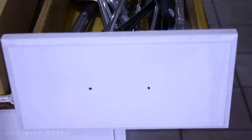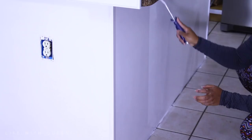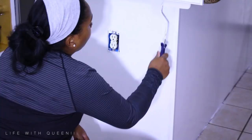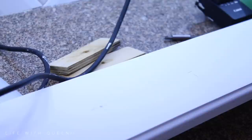When I restarted painting my cabinets, I used the same foam roller for all of the bottom cabinets, all the bottom cabinet doors, and all the drawers — one foam roller can take you a long way. After you're done or get tired from painting, put your roller and brush in a plastic bag, wrap the end around the handle, and put a second one over it — this way your foam roller doesn't dry out.